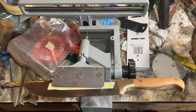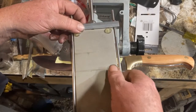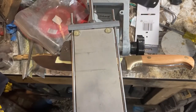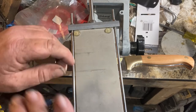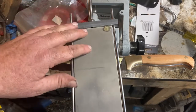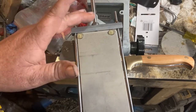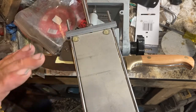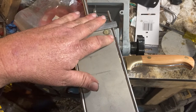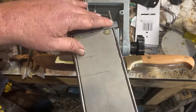I've adjusted my angles a little bit from a normal 25 degrees because I want that thicker edge behind this, and I've also come up to 45 millimeters just to keep everything level. There is a lot of meat on this so I'm not going to show the whole sharpening. This is primarily a breaking knife, so I want to have that thick edge in behind.